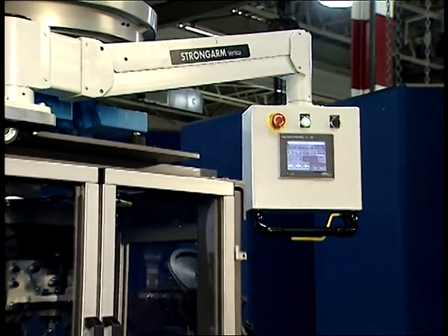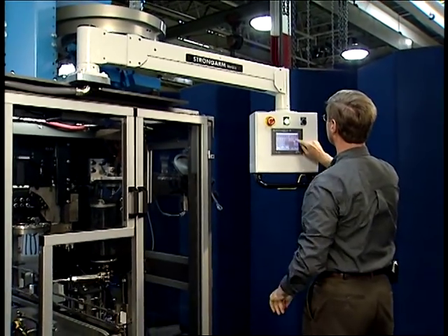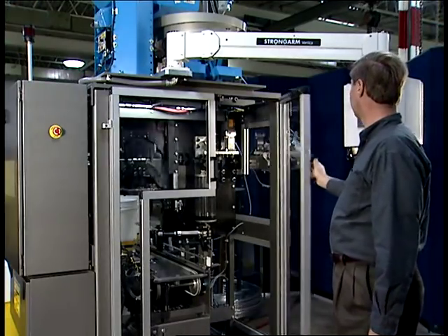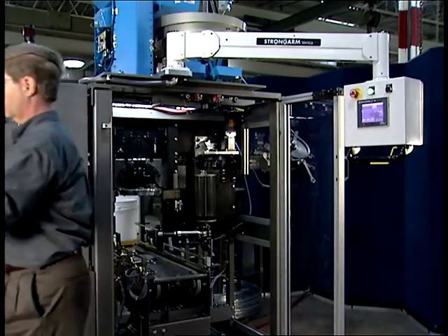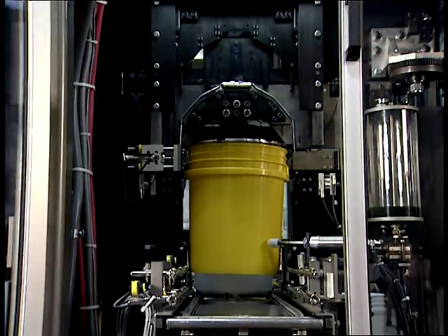The Heisler Compact Bale-O-Matic has many user-friendly features. These include an ergonomic strong arm for the operator HMI and an interlocked guarding package with easily opened and removable doors. Opening the guard doors interrupts the machine's operation and removes all stored air and electrical energy.